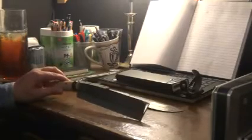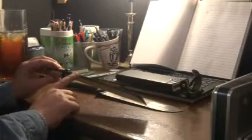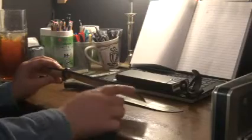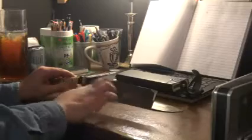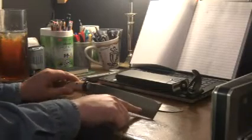The Japanese versions of those blades are extremely different. This is flat stock. It's not ground at all. The stock thickness is usually heavier. It's around 0.28 here, tapers to about 0.22, so it's even thicker than a quarter of an inch. And this is unground, just full flat stock. It starts here with a very light flat grind. And this is chisel ground.